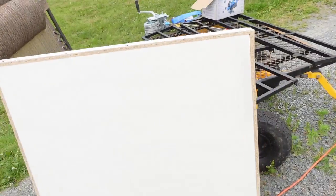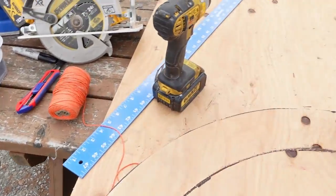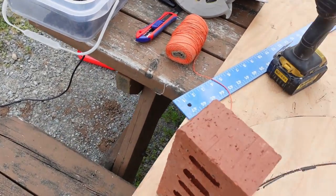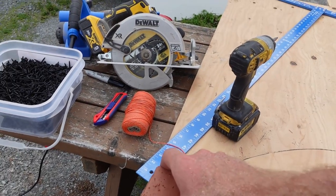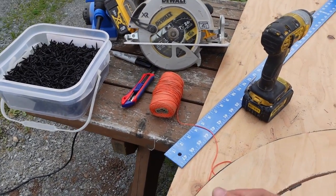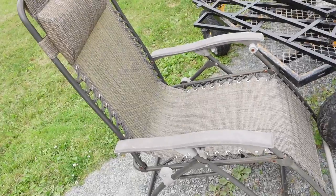I got the form for the concrete slab I got to make — three by three. Now I have made the arch for the bricks that are going to go around here. I originally cut it too big — I cut it three feet wide and I forgot I got to account for the width of the bricks, so they will sit on that and go around. I'm going to pour concrete in this and it's going to be my slab for the pizza oven to sit on. So far so good. It's been extremely hot today but we'll get it done.